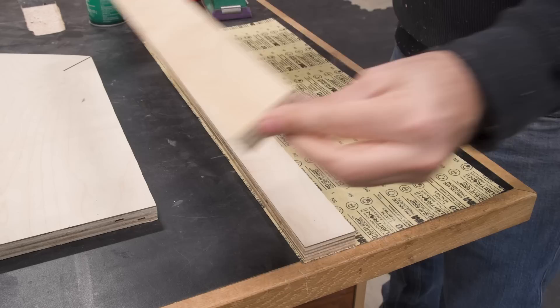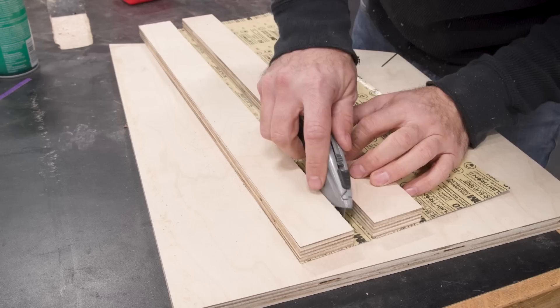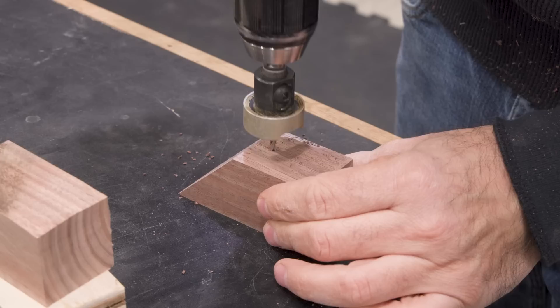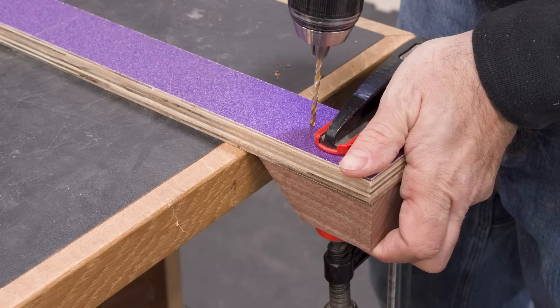Some spray adhesive should do the trick, and while I didn't do it here, you might want to apply some sandpaper to the angled face of the hardwood block — that'll give your clamp something better to grip on. Once the glue sets up, use a sharp knife to trim the sandpaper around the edges. The blocks are then pre-drilled and countersunk for screws, except I really wanted the screws to be on the plywood side, so those holes are now just decoration and I'll attach the blocks with glue and screws from the correct side.